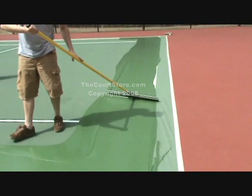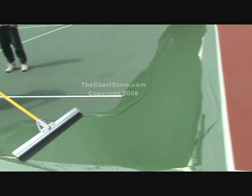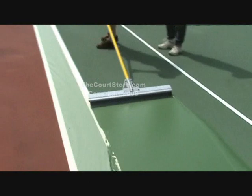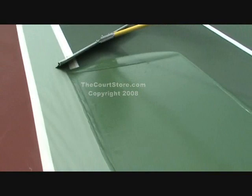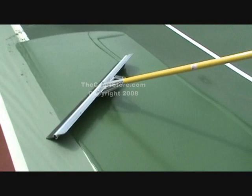Once you're a couple of passes beyond the start, the squeegee pattern you'll use will be the same all the way down the court. You'll notice he's pulling out what we call a tail — a real long strip along the side. He's going to turn around, but there's a little ridge on the paper that he'll pick up as he comes back. When he gets to the point where his row of coating is, he'll make a sharp turn and then walk straight down to the other side.